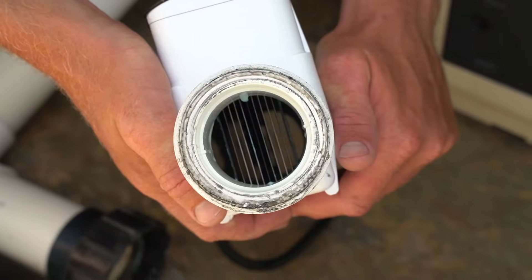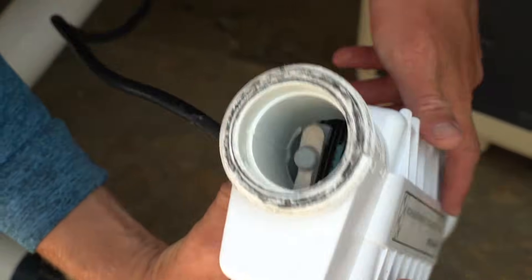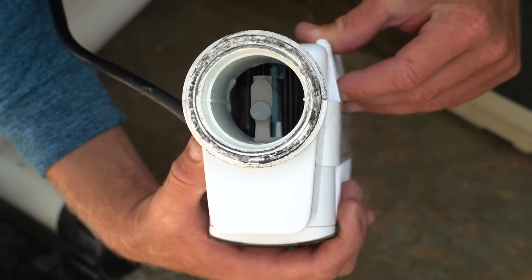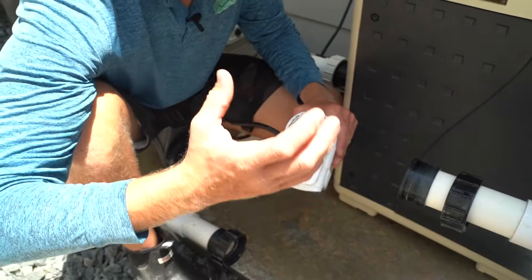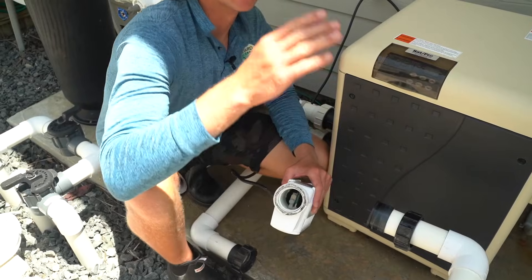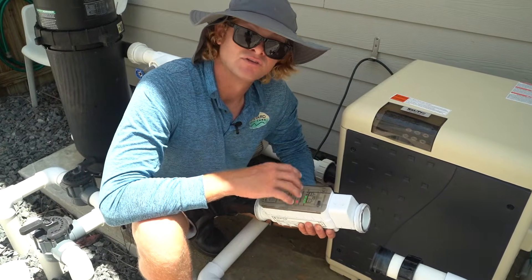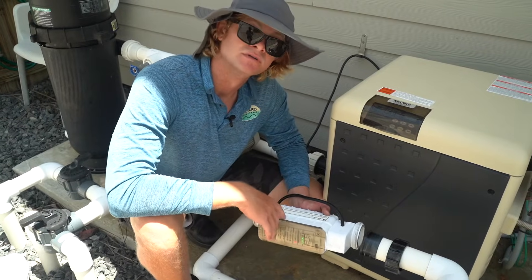When you look in here you can see a little bit of calcium. We did this a few months ago so it's in pretty good shape. You can see a little bit of calcium build-up on the wall — this is your flow sensor and you can see the grids down there. Never use anything metal or sharp because it'll take off the coating protecting the blades. Those blades are electrified; the salt — sodium chloride — passes through the water, gets electrified, and splits into sodium and chloride. That chloride is chlorine in the form of a gas going into the pool. Always make sure this is running on the correct time with the pool pump — if it's producing chlorine without water moving, it can potentially make enough gas for it to explode.